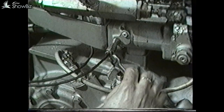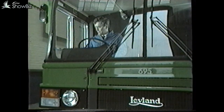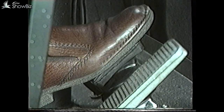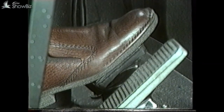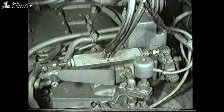Now install a pressure gauge on the retarder modulator valve at the rear of the vehicle. Start the engine and place in third gear. If the foot brake is now applied slowly in stages, the first movement will operate the retarder solenoid. The next stage will operate the first stage cylinder, and you should then have a pressure reading of 16 pounds per square inch. Then the final movement will operate the second stage, and the pressure reading should now be 27 pounds per square inch. If both these readings are correct and the twin actuator is moving, all is in order for the basic operation of the retarder.